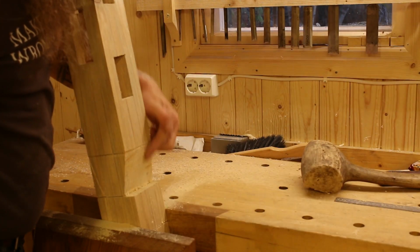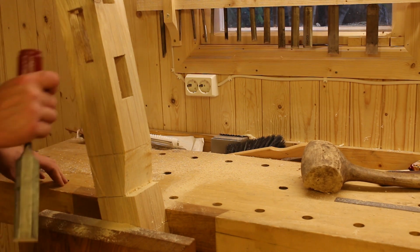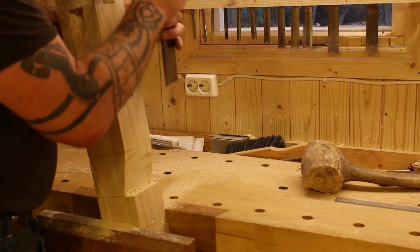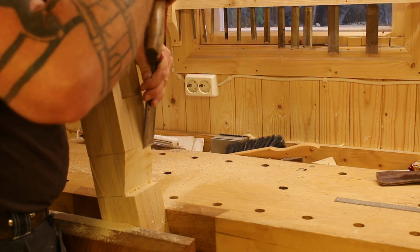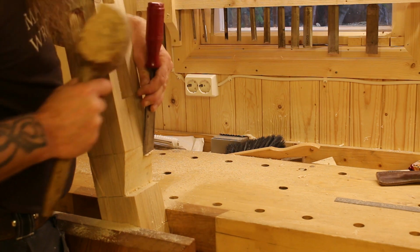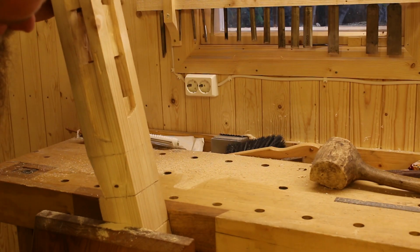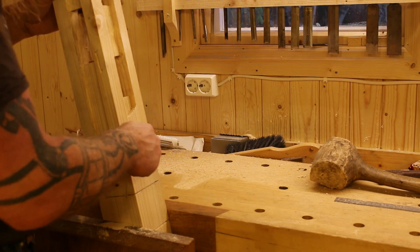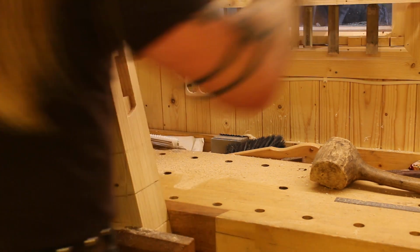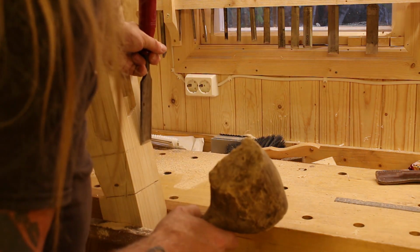Slipped out on this side. This is typically one of those things that's always turning out better when you're not shooting. But I will just use the chisel and dress it later like that. One thing I could do is to make a slightly deeper trench to start in.